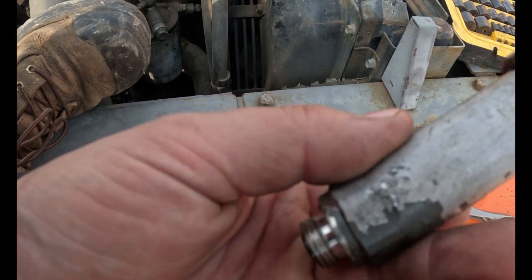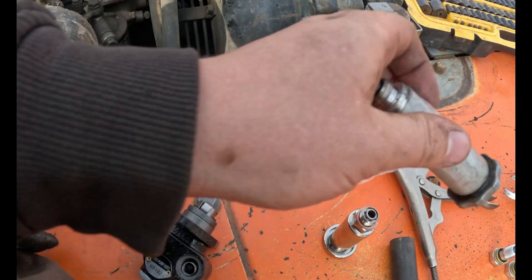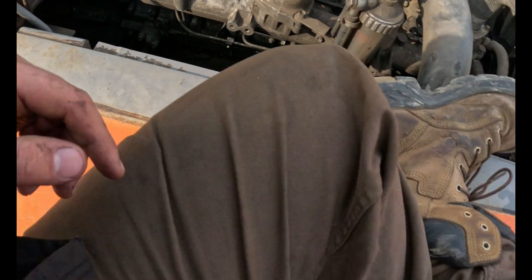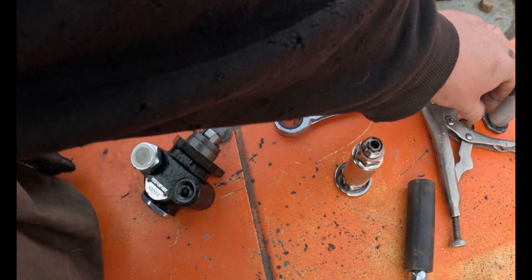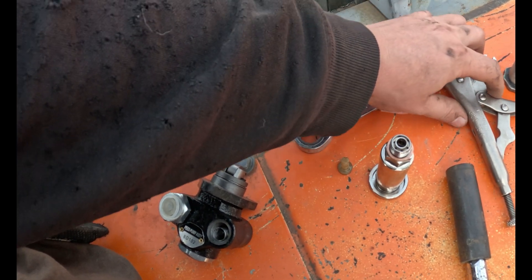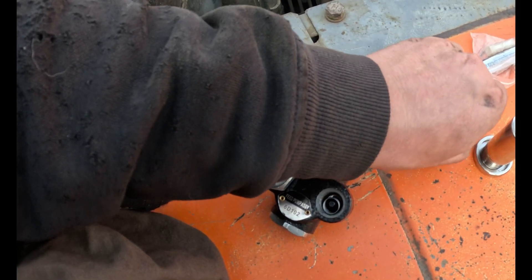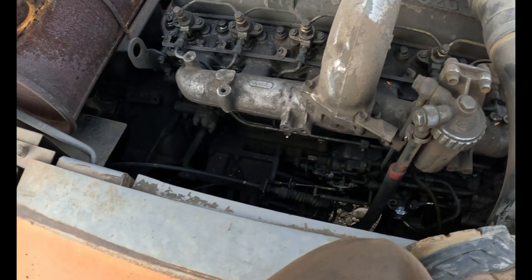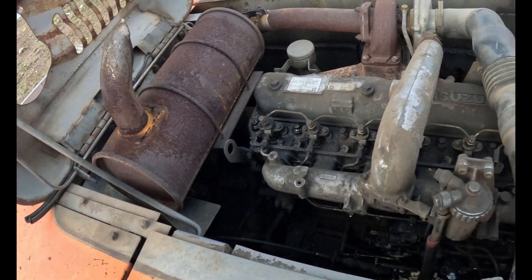You can see how clean this area is compared to everything else — I haven't washed it. Diesel is a good detergent so that cleanliness points to the leak source. I'm not sure if the plunger and spring from the new one are the same as the old, so I'm going to leave the factory ones in or put them back in. We'll put the spring back on, drop them back down in there, fire the machine up, let it get hot, and see if it still leaks. It was a pretty decent drip so we should have an answer shortly.